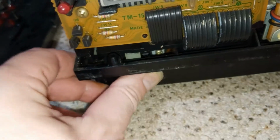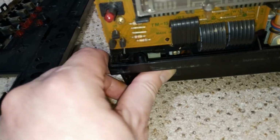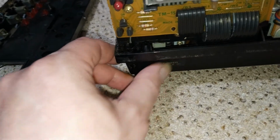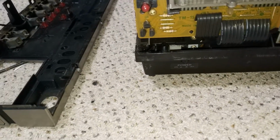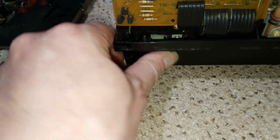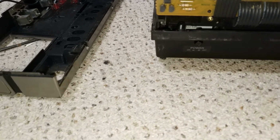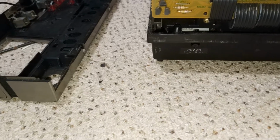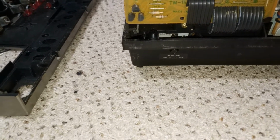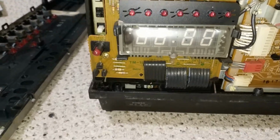These switches can be problematic. Sometimes they don't latch properly, but sometimes the actual internal mechanism, it's a bit like the Sony TVs of the time, the actual sprung mechanism, because they flick the contacts really hard with the spring, although I don't think this is quite the same as the TV. This feels like just bog standard TV stuff. But on the Sony TVs, they would use really strong springs to really thwack the contacts together so you didn't get an arc, just so they didn't spot weld themselves to each other. But as they got older, obviously they did. And more often than not, they would blow enough away to make them open circuit. So yeah, I don't know whether that's interesting, but anyway,